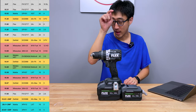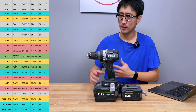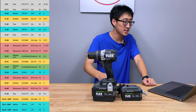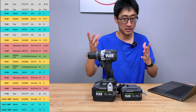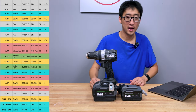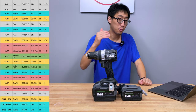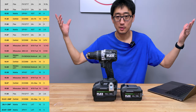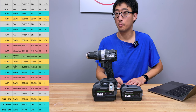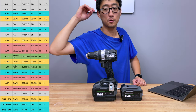This is obviously the top leader on the leaderboard, but let's be realistic. If you're working most or all day, you do not want to be wiggling this thing around for standard stuff — it weighs almost 7.5 pounds. Most of what people do day-to-day will be fine with 3.5 or 5 amp hour packs; you don't need the 10 amp hour. But if you need ridiculous power — drilling big holes or doing earth auger work — this is the peak performer on the market right now at the time of this posting. Hope this video helped. If you have any questions, let me know. Have a great day, do some great work, and we'll see you guys next time.